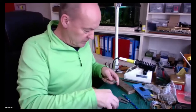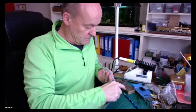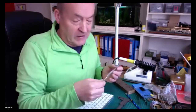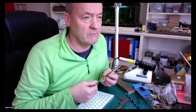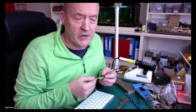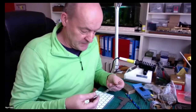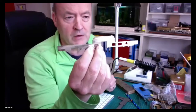So this is made of nickel silver, and two frames laminated together is just shy of 2 millimeters. So let's call it 1 millimeter thick framing. So in real money, it's probably way over size, probably double the thickness of a frame on the real thing. But you need some sort of strength. And as you can see, this thing looks fairly flimsy.